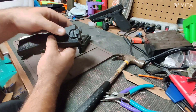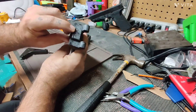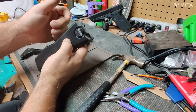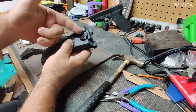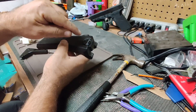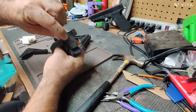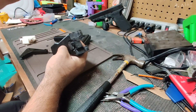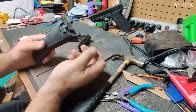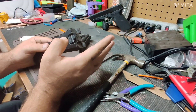For example, the button — the pin goes in from the front and there's no hole to get it back out without destroying it. I'm not going to get that out. It is simply the 3D printed button, a spring, and a three millimeter pin by whatever length the instructions reference. If you can't find it in the instructions, push a long pin down in there and mark it with your sharpie or whatever.